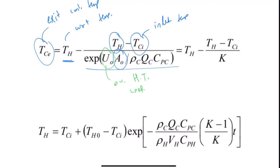If we had a terrible heat transfer coefficient, our immersion heat exchanger wouldn't be doing anything. It's not taking any energy out of our system, so the temperature's not going to cool down any faster, and we're going to defeat the whole purpose of this thing. So ideally, you spend money on the right materials and figuring out the right flow profiles to have.